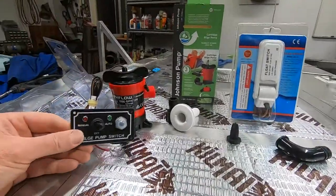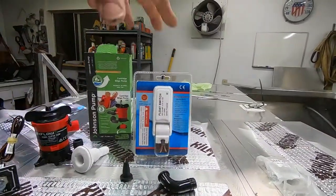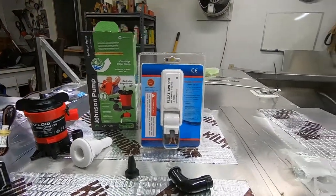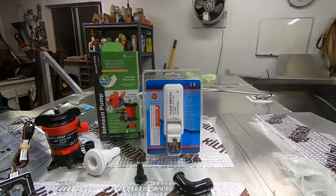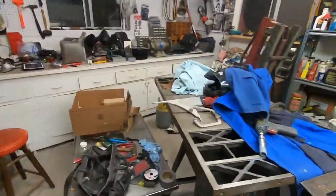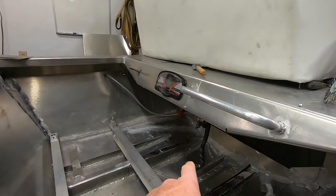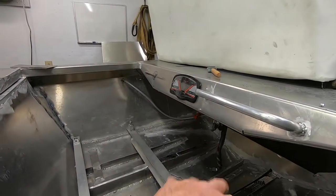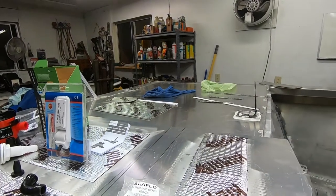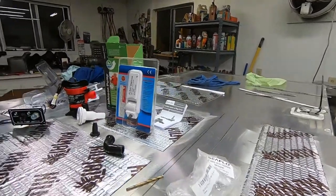That's the build setup. I'll hopefully get to the installation this weekend. I do want to put the bilge pump in before I start adding exhaust and other things — it'll be easier to get to those positions. It's pretty tight down on the bottom there. I ordered some bolts, got some in today, also ordered pan head screws for the floor so there's no rough edge sticking up. Got the new engine hatch screws in — the tapered heads so bolt heads won't stick up. We'll be back at it this weekend.